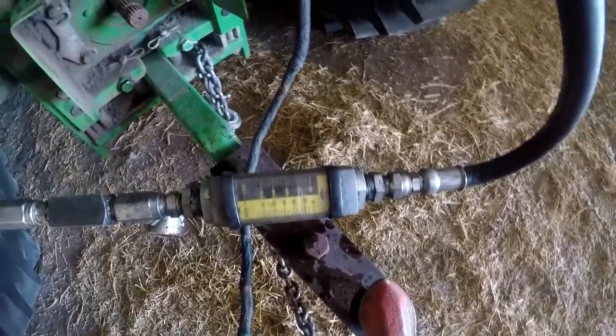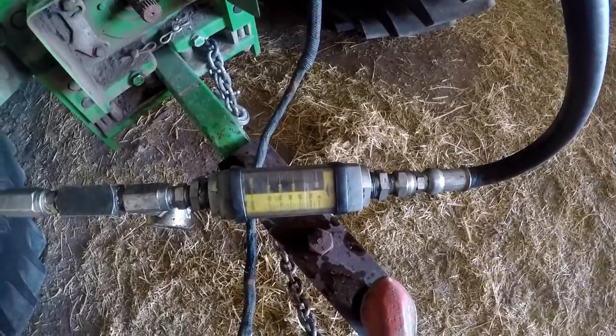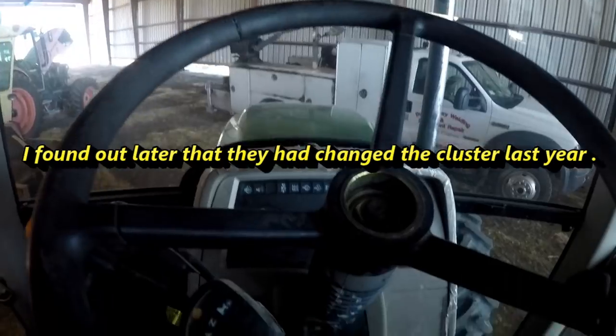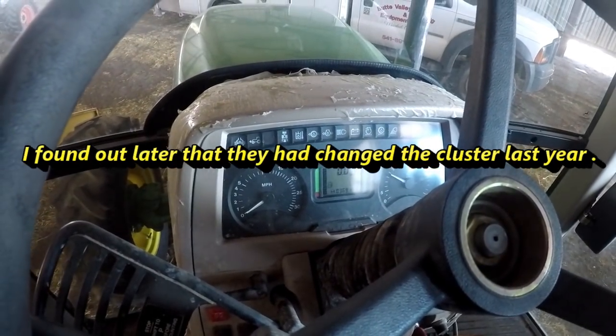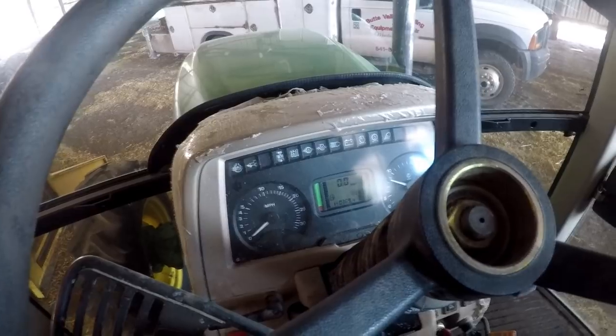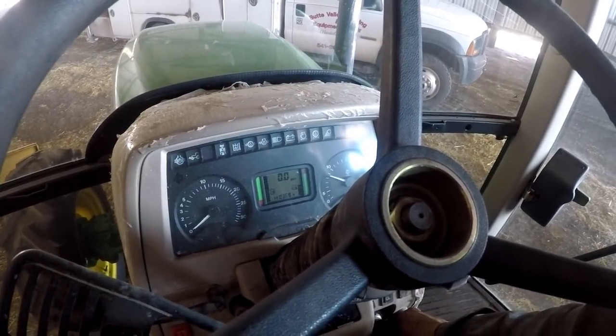Well, the hotter the oil gets, the worse it gets. Saying it's about 11 gallons per minute. It's 3 gallons a minute lower than what it should be. Can't believe at 369 hours it's got a pump problem already. That's pretty unheard of. That is not right. Okay. I got the pump loose. That's full of suction, so I get on that one bolt.